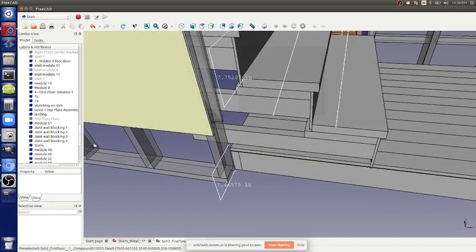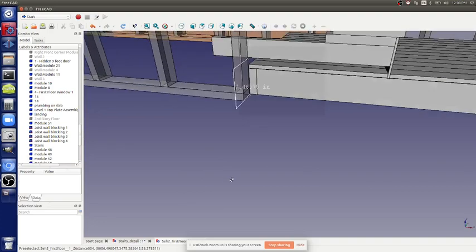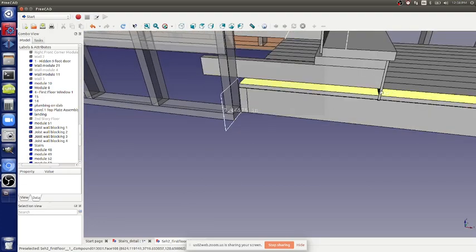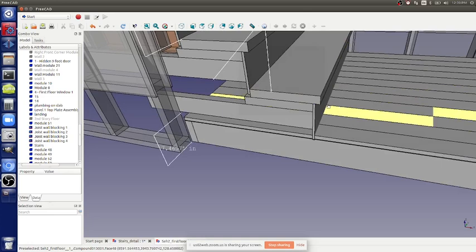Do you remember 7.75 from the dock? That's the max rise, so we're actually using the max rise feature. We are using 7.75, which means that this first step is actually not regular. It's just a little bit above, which is allowed. The first step can be non-regular. Everything else has to be regular, including the last step. But when you do a platform like this, for the first one there is no requirement. The first one can be off.